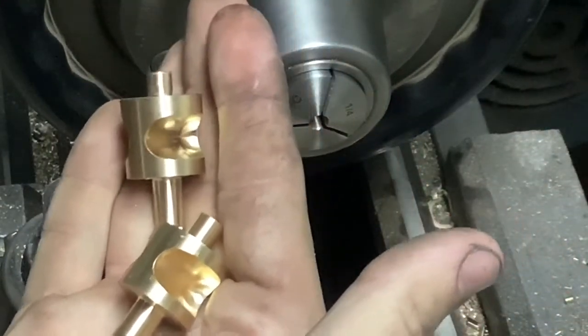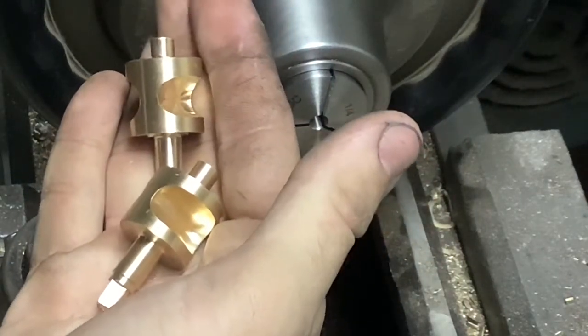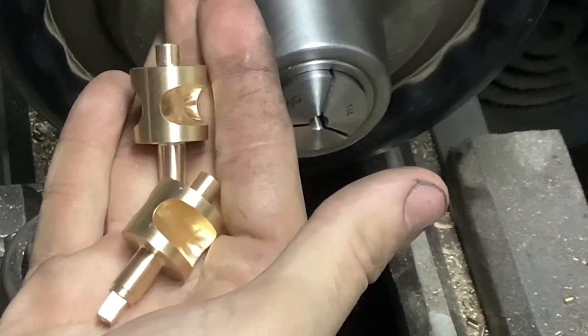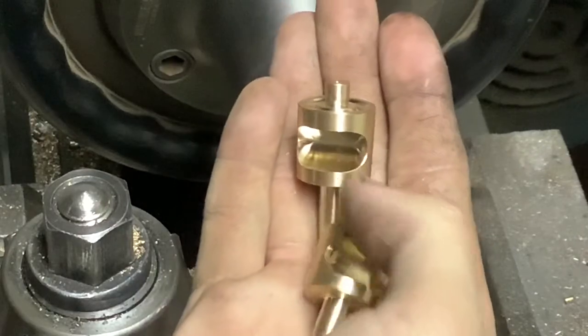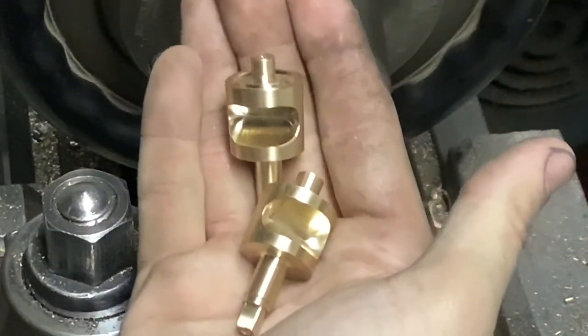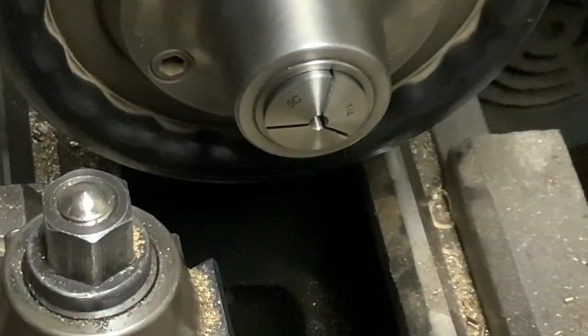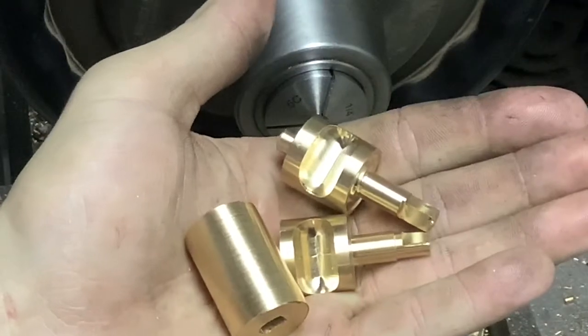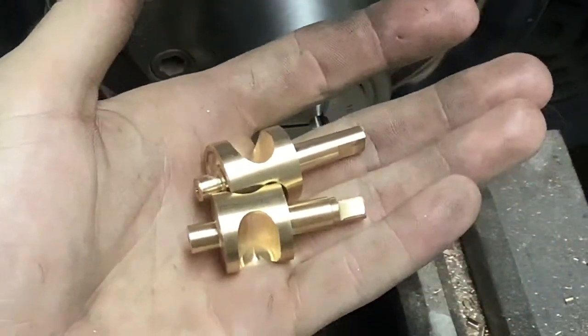These are going to go into a sandblast after I clean up the insides of the ports with rubberized abrasives, then they'll sit while I make casings. I'm waiting on my die to be finished for the smaller 468-size knuckle, but once that gets in I am full steam ahead. I'm very excited about this project - it's a lot of fun to make these, and it's a lot of fun to show people that it is possible to do these well on manual machines. So I'm going to shut off here. These turned out really well - looking forward to making the casings. The rotors are stressful, but thanks for watching.